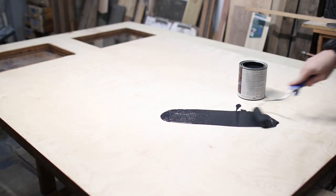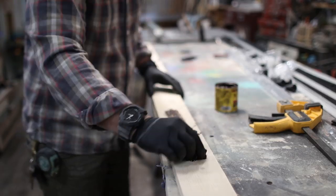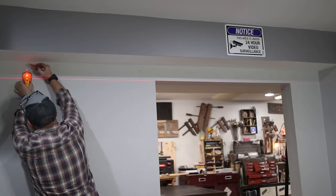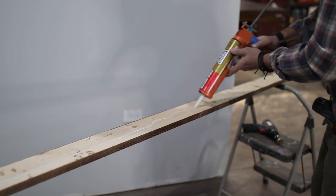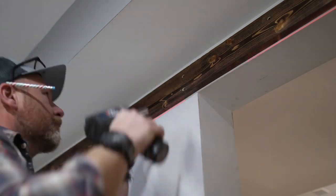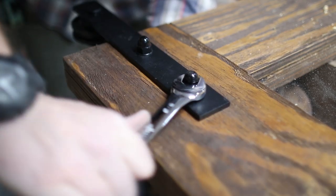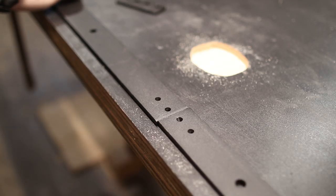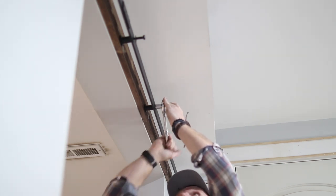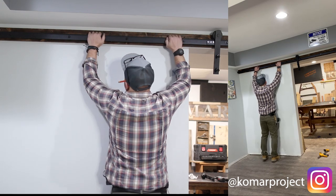This door is about 150 pounds, which for a barn door this size is nothing. Here I'm installing the pine header — since I'm going to be putting in acoustic panels, I needed to bring this door off the wall a bit more and that header is going to give me just the clearance I need. Next I started installing the track kit to the door and to the wall. I needed a rail around nine feet long and the closest thing I could find was a 10 foot kit on Amazon for 65 bucks. I'll leave a link to it and all the materials I used in the description below.